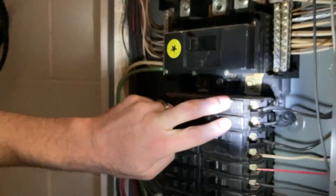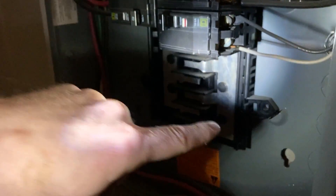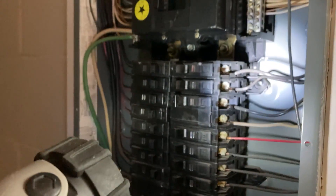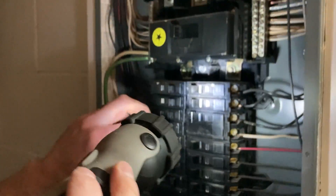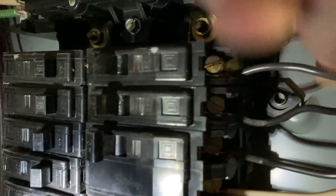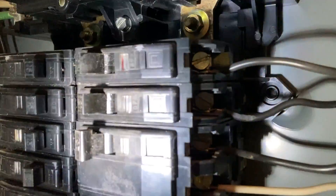Like I said, we're going to move these two — we're going to disconnect those. We'll have to add some jumper wires to make them long enough to reach down here, and you'll need some 12 gauge wire. We'll just strip some and wire nut them on there to extend it. Looks like we've got a 20 amp here and this one's a 15, so I need to make sure I get them in the right spot — the same wire hooked up to the right breaker. I believe one's for the kitchen, one's for the furnace.